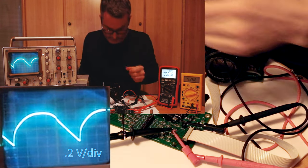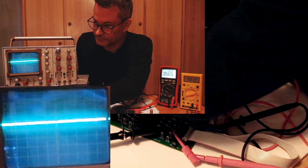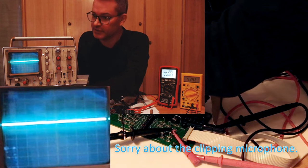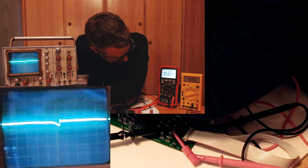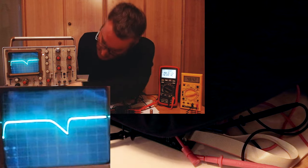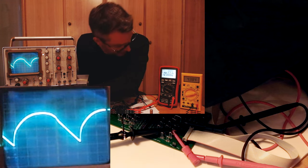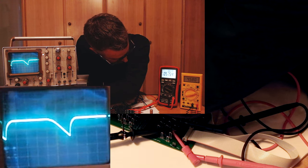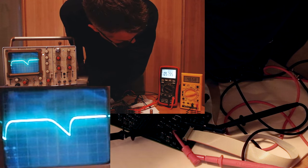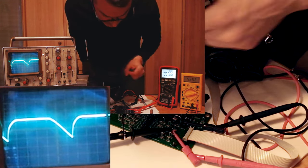There is definitely a change in the ripple below 5 volts input. At 4.9 volts, ripple is still looking fine. As we go further down to about 4.6 volts, the ripple is about 0.5 volts — you see that below 5 volts the quality of the regulator output certainly degrades. But until about 5 volts it is doing just fine.